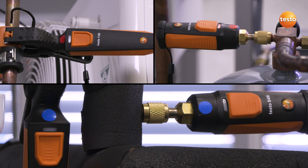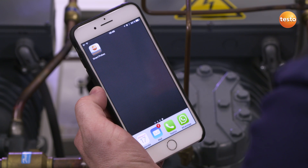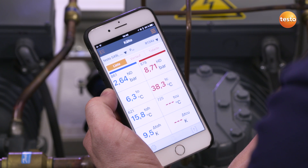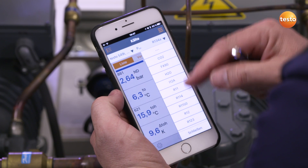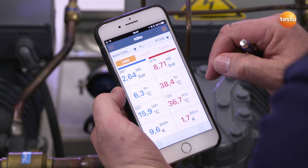This is how it connects to my smartphone. All measuring points are now set. Next, I can initiate the Smart Probes app, already downloaded for free, and establish a connection. Our four sensors are detected by the instrument. The first thing we can do is select the refrigerant that we use in the system — in our case, it is R134A, which has already been preset.